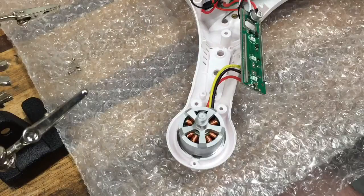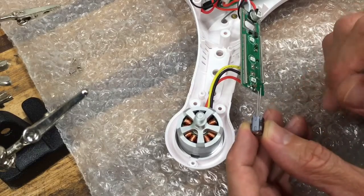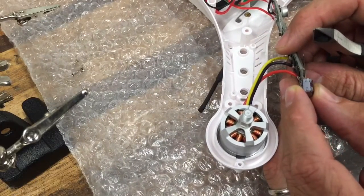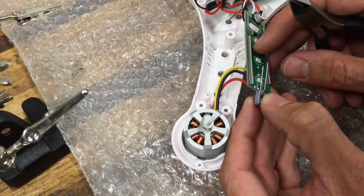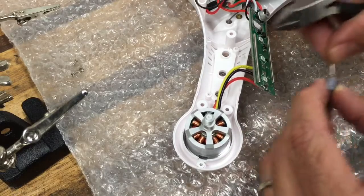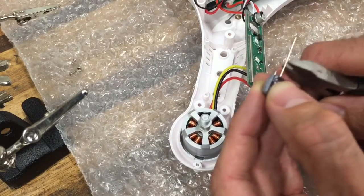The first thing we're going to do is cut the capacitor leads. As you can see, it goes right there. This side — I'm not 100% sure if that's positive or negative — but that marking goes on the right side of the speed control. I'm going to take my cutters and snap that off. I'll check the length — looks perfect — and then cut the other one.